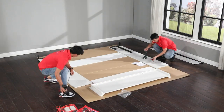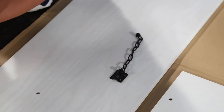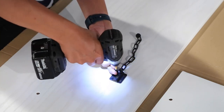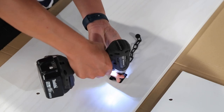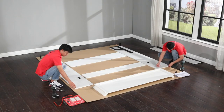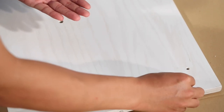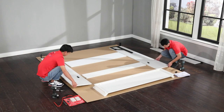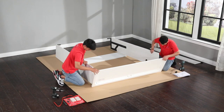Remove the safety chains from bubble pack number one along with eight of the K123 screws, and attach the safety chains to both side panels. Insert a K111 barrel nut into the hole on the upper corner of each of the side panels and align them.